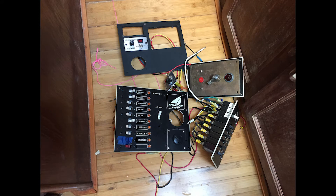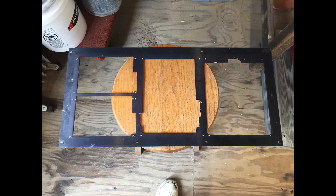Here are my old electrical panels — the original Morgan DC panel, the very small AC panel, the by today's standards oversized breaker for the windlass, and a fill-in panel that I had cut out and made to hold the bilge switches, alarm siren, and a multimeter. Definitely time to be replaced. Here is the original mounting bezel — as you can see, it's been modified by quite a few different owners. My original plan was to use it and just mount the new 360 panel right inside of that, but there was just too much open space around it, so I had to pull it out and make a new one.